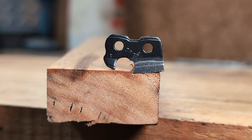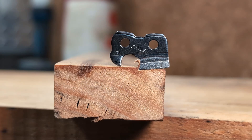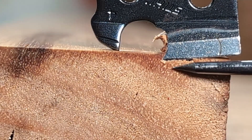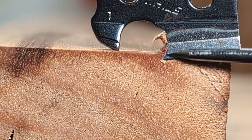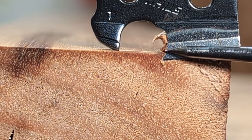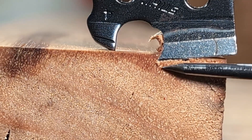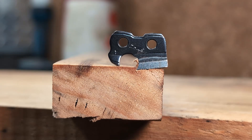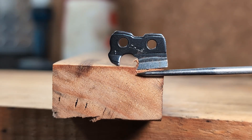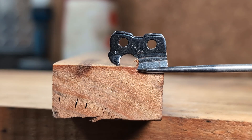This may work in some conditions but it's not something that really works for me with the timbers I'm cutting. This cutter is set at its factory angle of about 60 degrees. You can see with that 60-degree angle that the very leading edge of our chain - the corner - is in the wood quite a distance before it's actually being severed off and broken. The tip of the pointer is essentially where it's being broken off, and the very point is down here. That is where some of my ideas regarding reducing side plate angle come from, because in my experience bringing that more into line with where it starts to peel off is generally a more efficient shape in the hardwoods I cut.